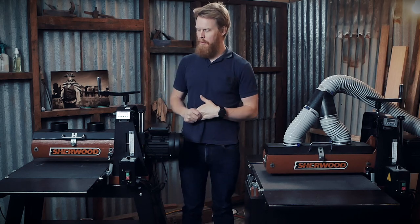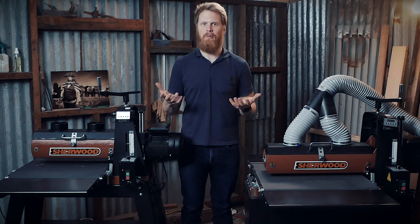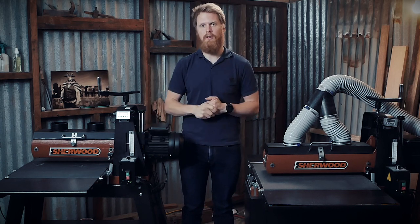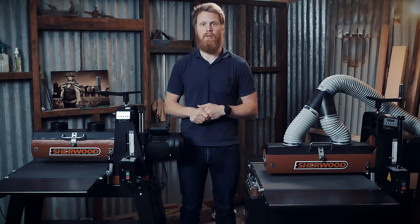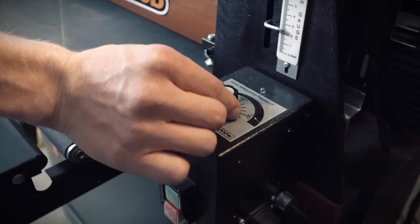The similarities between the two include a digital readout to a hundredth of a millimetre, though it does require the operator to use it competently. Your height adjustment is by hand and it has a manual depth gauge, but it also comes with a digital readout. Both feature adjustable speed on the feed table, while the spindle constantly maintains 1500 RPM.